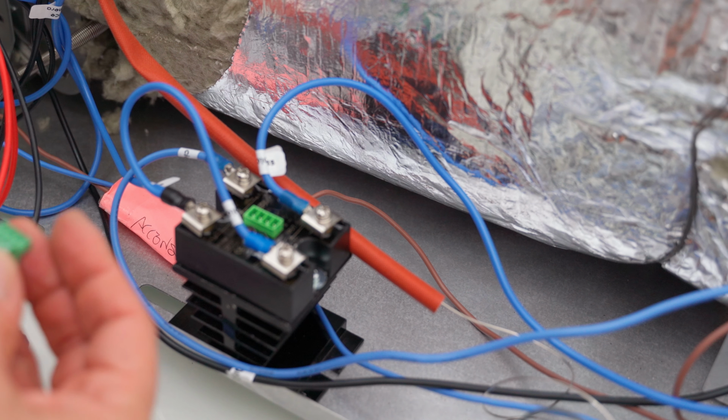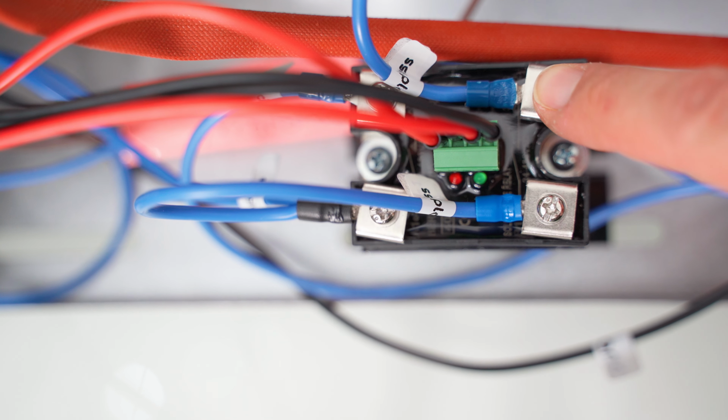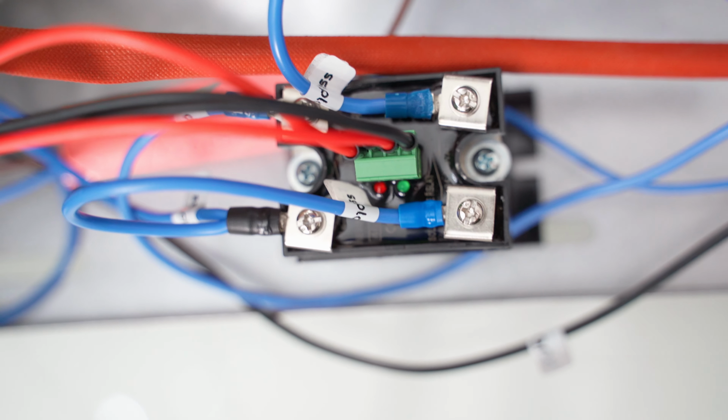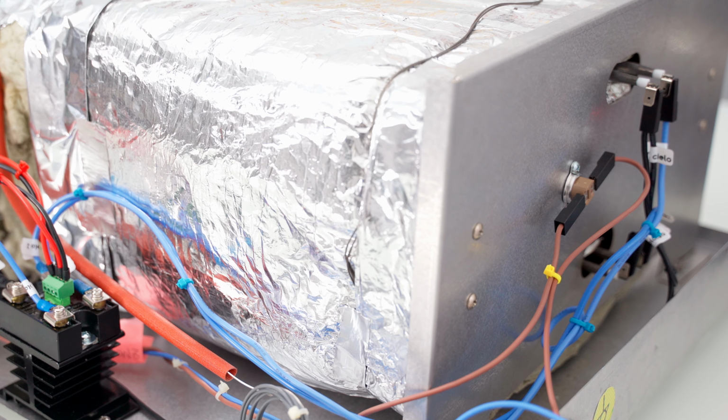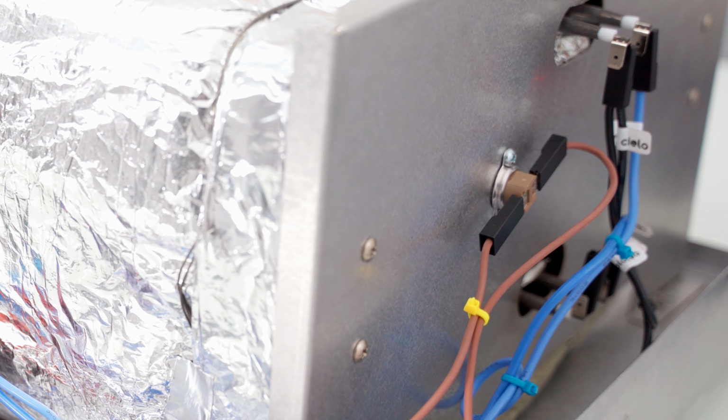and bottom heating elements. So as we can see, we will have the lower heating element connected to B1 and B2, while the upper heating element will be connected to A1 and A2. Then obviously we are going to complete the connection inserting the fastons in the back of the oven connecting to the upper and lower heating elements.